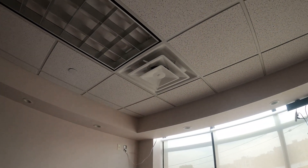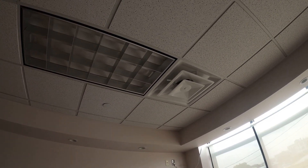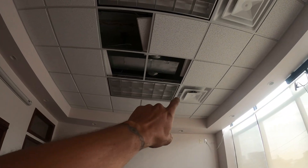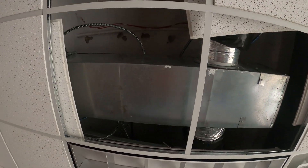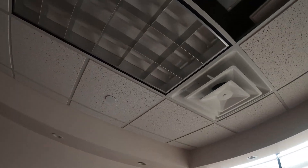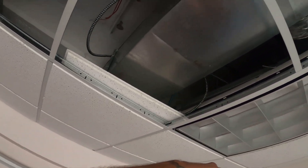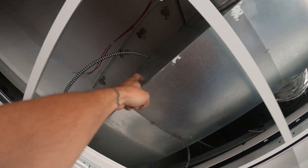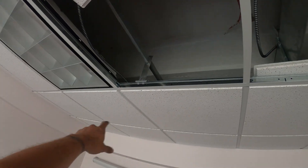Right there there's a little piece of tape so we can see the air is flowing through. Wherever that connects is going to be our supply duct. We're going to tap into there and add a diffuser somewhere in this area. So that diffuser is supplying. Here's the duct. I said he didn't feel any air on that one but there's got to be air coming because that's the takeoff. The other room is freezing compared to this one, so what I would do is tap in right here and bring in some flex duct into this area.